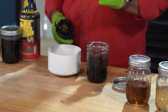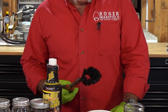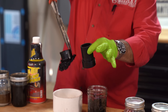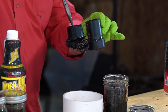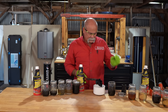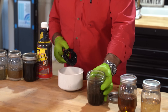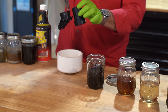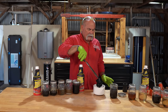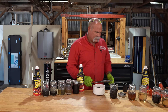I love all these plumbers, homeowners, and DIYers that tell me these chemicals don't mess with your pipes. Really? Now remember, this is what we put in and this is what just came out. If you are going to tell me that some of these chemicals don't mess with your pipes, I'm going to tell you — you're wrong. There's what's left of the pipe. You can see where it dissolved, started dissolving from right about here where my thumb is from there down. That's what it looks like now. That's what it did. The chemicals will stay in the pipe if there's a belly.